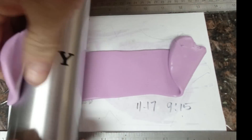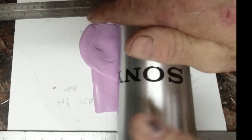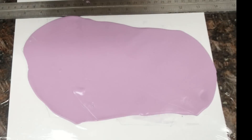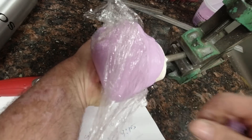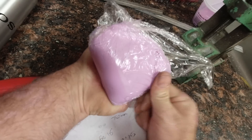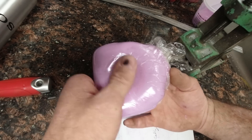Start by thoroughly mixing the two parts together so you don't have any stripes — you want a nice even color. Remember, the clock's ticking, so hurry up. You don't really want to be worrying about camera position and framing. Now that you have it sheeted out, about big enough to cover most of the line drawing on the paper, get rid of the rulers and drape the silicone over the plaster. Start working on joining the seams — be sure to rub the two edges together so they become one. Here I was a little leery about ripping off a piece and adding the excess to another place on the form, but it seems to have worked out pretty well. Be sure to keep holding the putty into any hollows, like what I have in the center of the palm. It kept wanting to lift up like it had air trapped underneath it, but eventually I worked the air bubble out and it stayed down.